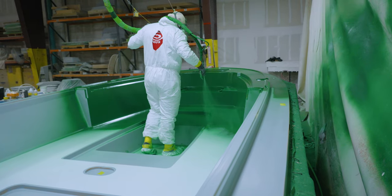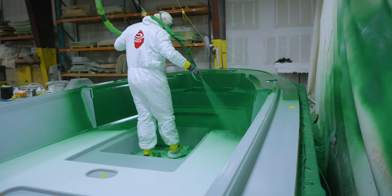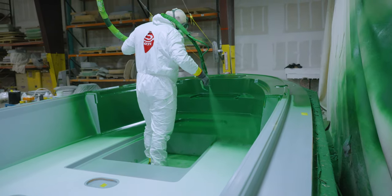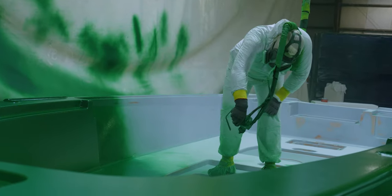Surprisingly enough, making a mold is similar to building a regular fiberglass part, and it all begins with a layer of gel coat. The gel coat you are seeing is brightly colored and it's called tooling gel. The bright colors help to identify a bare mold once complete.